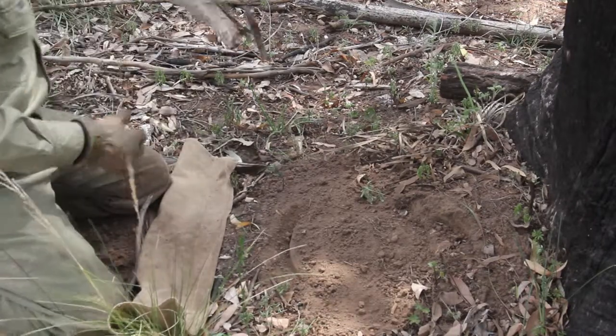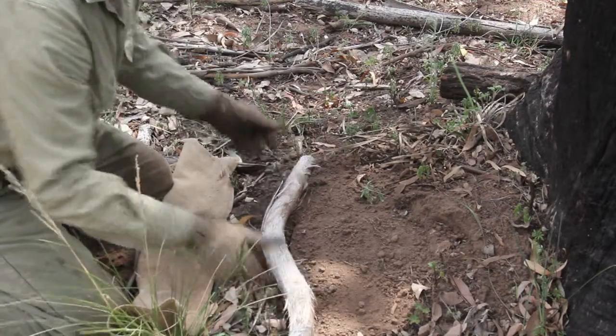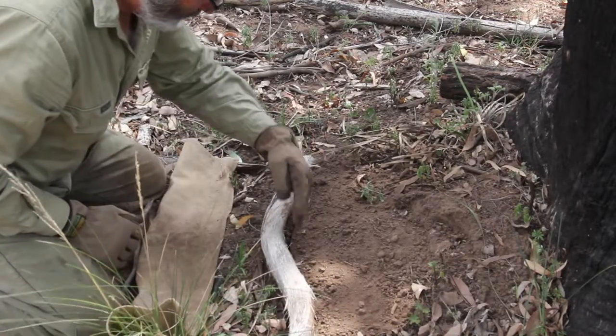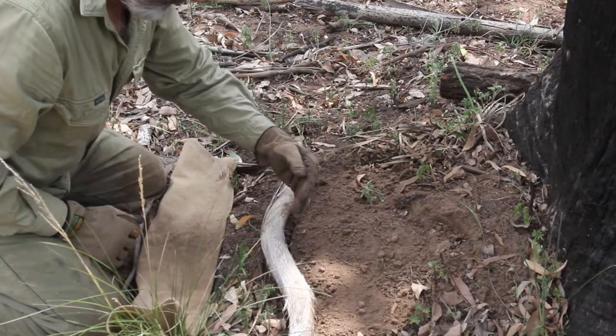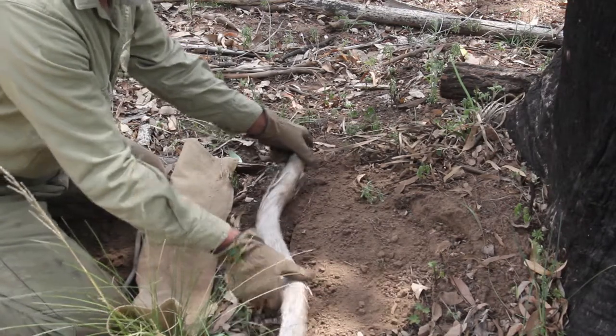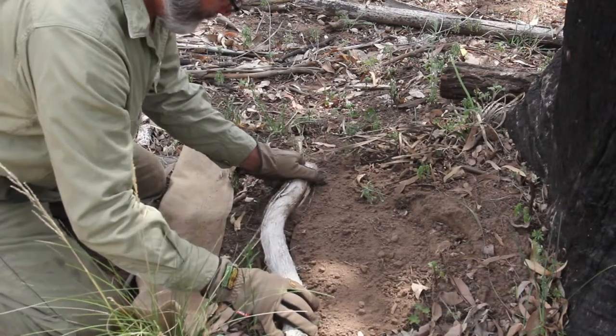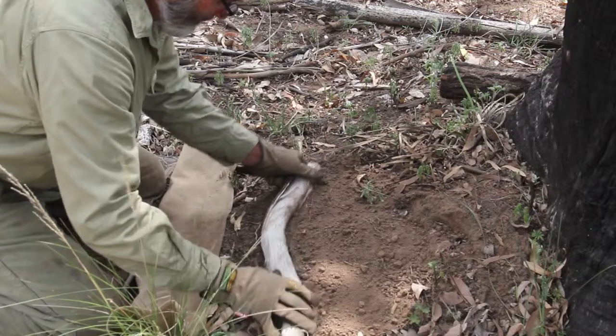Now this is our trip stick — what's known as a trip stick. You place that just in front of the front jaw, not over the jaw, because the jaw will come up and it will hit the trip stick. You don't have it sitting out here; you have it within millimetres — right within millimetres of your front jaw — and you bed it in.